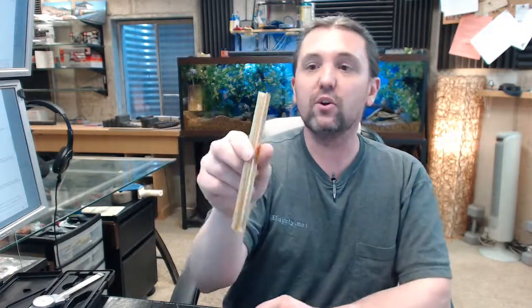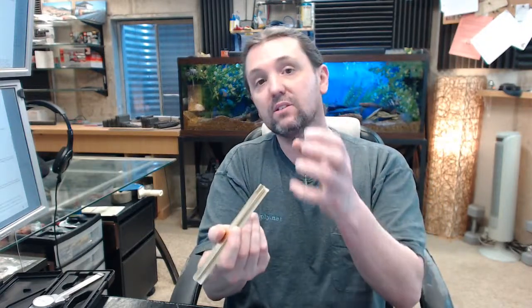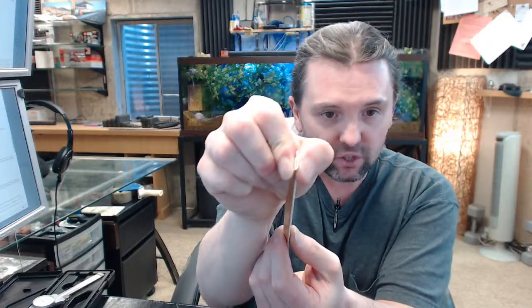This material is also considered a lock strip. Where you might have a spring bronze or a larger V-cushion, you can't run that larger material down over the strike plate on your frame. So there will be an interruption there, and you can tuck this in behind the strike plate against the face of the stop, and that material will act as a weather seal.